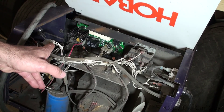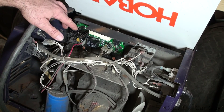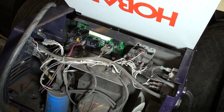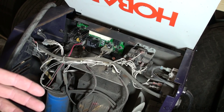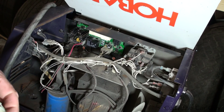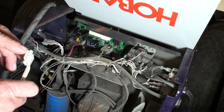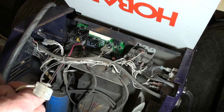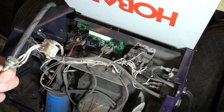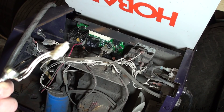What had happened was when we did the ohming out on the rheostat — if you have any problems and you're trying to see if it's the rheostat or the chip that's gone bad on your Hobart, you can message me. Pretty much you're going to go from zero ohms or two ohms up to about 40 or 50 ohms, and then on the other side of the plug you want to be up to 70 ohms. From the center pin, one side should read the low side of the range, and the other side should read the high side. When you rotate the switch, your ohm reading should go up and down. If it doesn't, your rheostat's bad — just change it out, it's not very expensive.